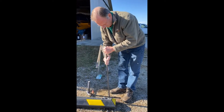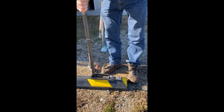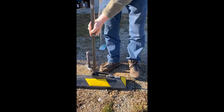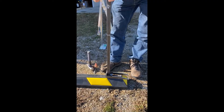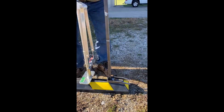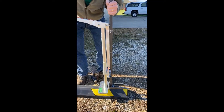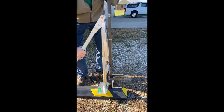When we raise up the block a little bit, it pulls the stake out of the ground and leaves it above the parking block. Then we can use the second part of the adapter, which is a recessed part that grabs the head of the stake, and go back and use the Jackjaw on top to finish it up.